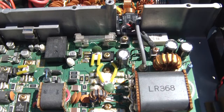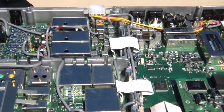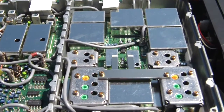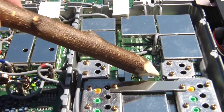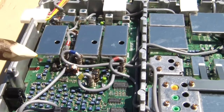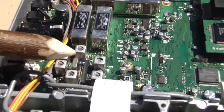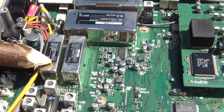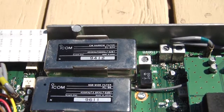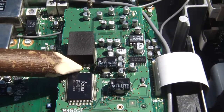Let's take a look at the bottom. Here's the bottom side — we'll take a closer look. In this section here, we have the two VCOs and the PLL. Over on the left, we have the amplifiers — pre-IF. Moving up top, we've got the crystal right there. We have our filters: SSB and CW installed. Over to the right, we have the DSP board. Underneath that board is a switch bank.